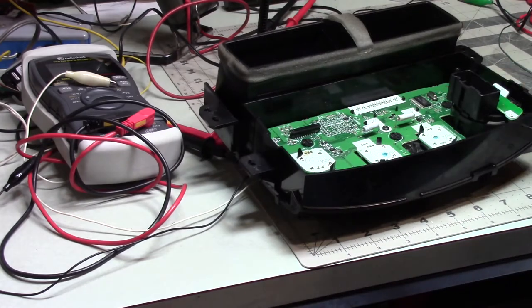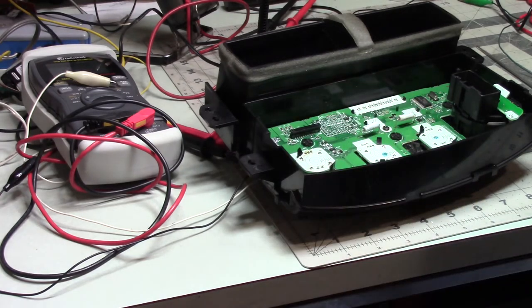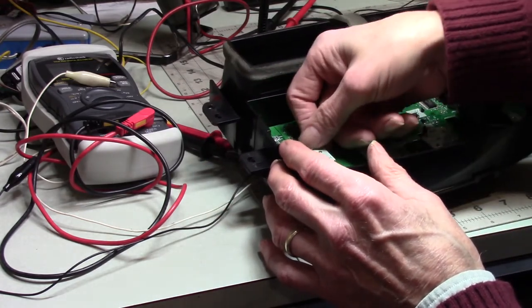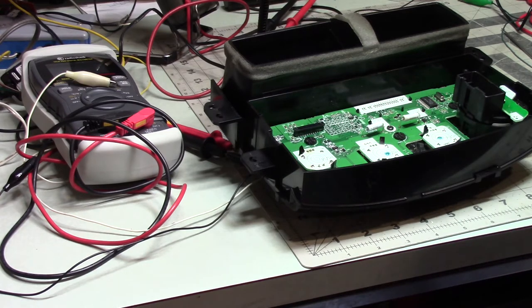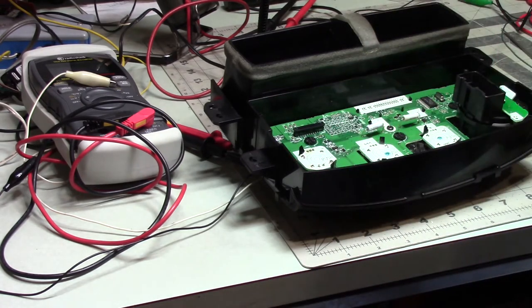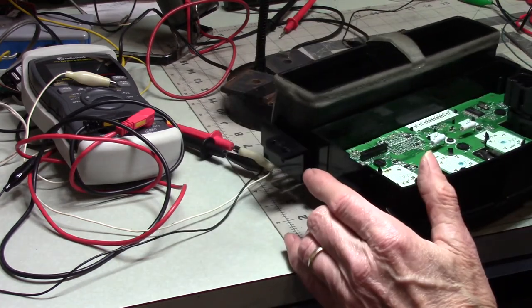So, like I said, I'm going to put this back in my van and we'll find out, but I'm reasonably confident that was my issue based on how it was behaving, because if I hit a bump, sometimes it would turn off or it would turn on, depending on the bump. So that wire was just barely making connection. I was puzzled as to why this control would have gone bad. All this stuff on here, I just cleaned this off too. I was puzzled as to why the switch would go bad. Now, I know on my radios, the contacts on the volume control would get corroded, but this is more like a volume control. And yes, those do the same thing, but they don't behave like this. Not quite. So I think this is my problem. So I'm going to put this back together again, and we'll see. And I will let you know.